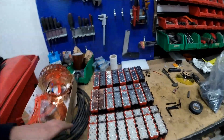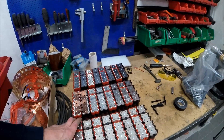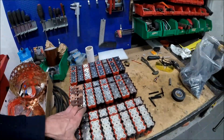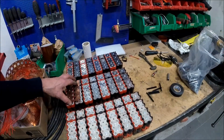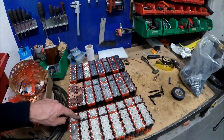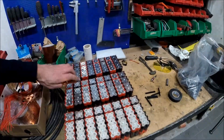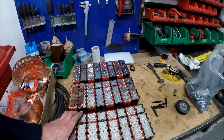You can see the battery pack build. It's 336 batteries. I've made another video on how to build these earlier, so if you check out my channel you can find some information about it and also some links where you can buy these components. This is built to cope with 400 amps and the total energy amount is 2.6 kilowatt hours.